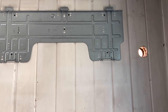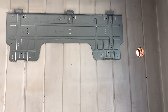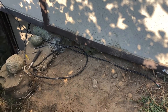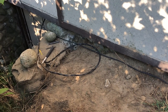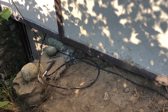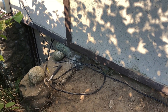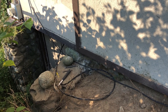Now we're going to open up our outdoor unit, verify that we've got everything, and then start working on our electrical connections out there. We have six/three gauge wire, which is a little bigger than what we need for this unit — we probably could have gotten away with eight gauge wire — but we sized it bigger because we may add another unit later. So we're using a 50 amp breaker inside and a 50 amp breaker outside at a spa disconnect GFCI box. You don't need the GFCI, but that's just what we bought.